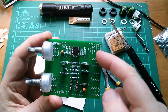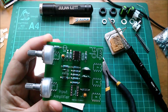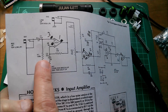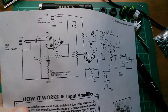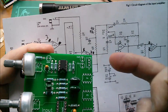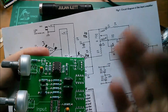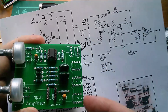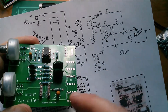That's about as far as I can go because I can't find my electrolytic capacitors. I'll probably put 47s in there. That frequency-dependent one I should probably get a 22 microfarad for — the parts list says tantalum, so I'll see if I can buy some 22 microfarad leaded through-hole tantalums. For the decoupling on the power supply I might just put 47s in — really doesn't make any difference, in fact it would help. I don't think I've got a three-pin JST so I can't fit that connector, and I'm waiting for my daughter boards to fit the RCAs.